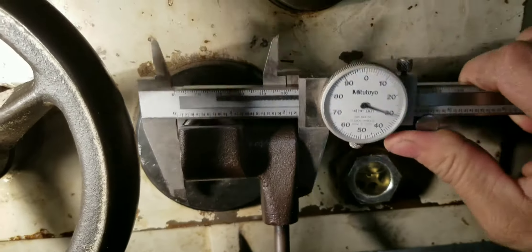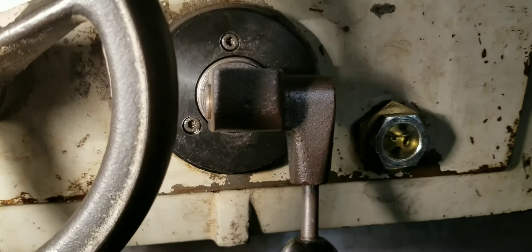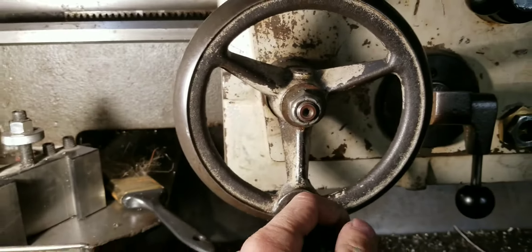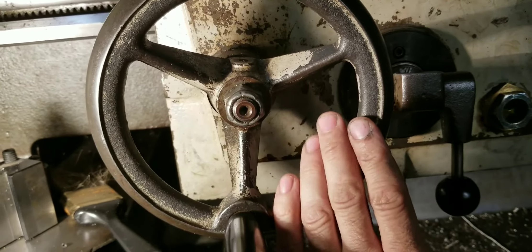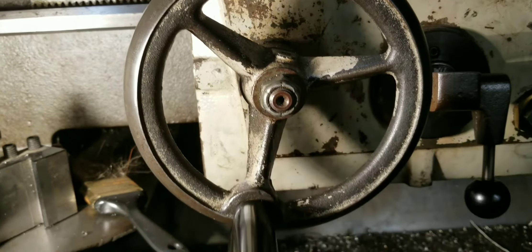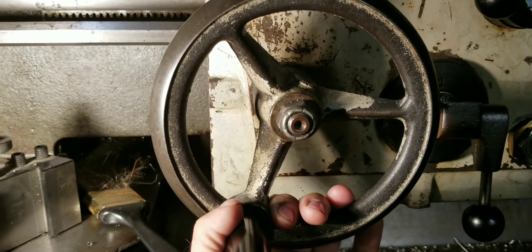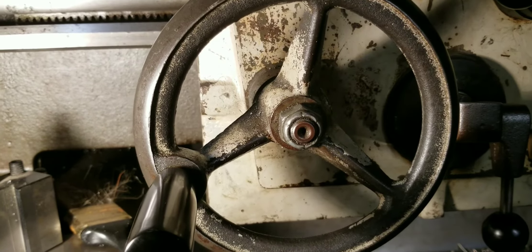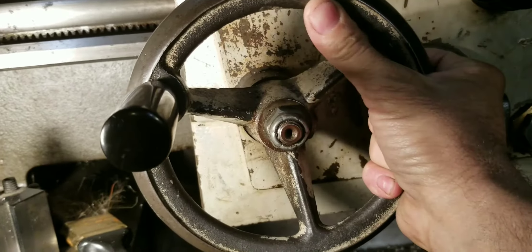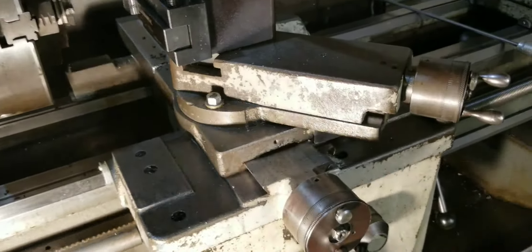The block is about two-and-a-quarter inches that way, and about an inch-and-an-eighth square — you'll probably have to mill that down since you can more readily find inch-and-a-half stock. Your hand wheels are identical for both positions here and are seven inches, although I'd almost recommend going with a nine-inch on your carriage — that's probably user preference. A bigger wheel makes turning a bit more accurate, especially when putting corner radii on by hand.